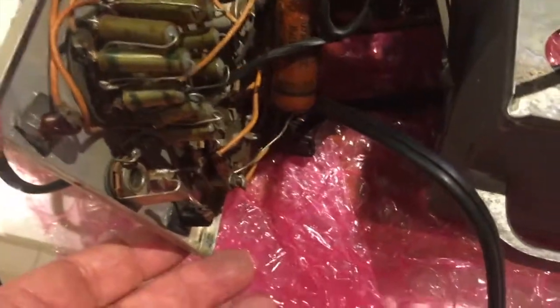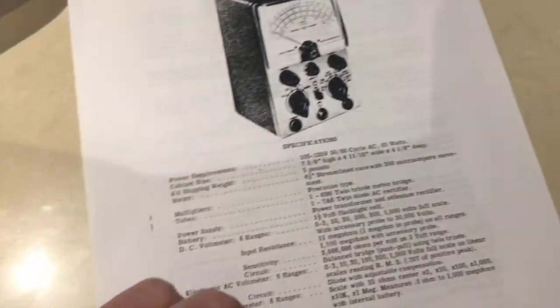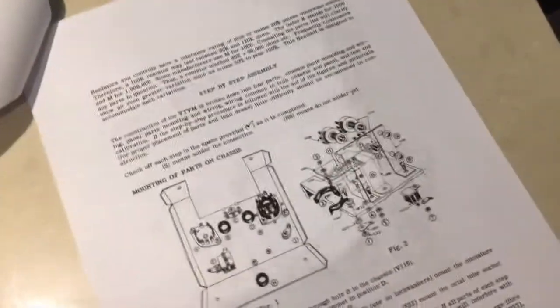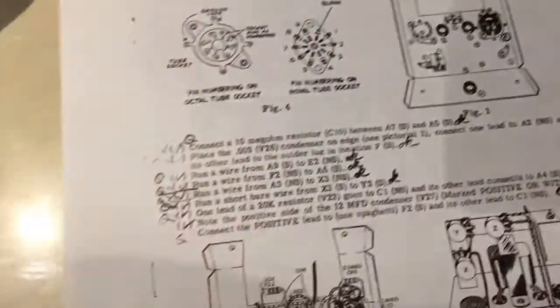I don't have to use the VTVM — I've actually got an oscilloscope I could use, but oscilloscopes are obviously much more difficult to set up and adjust. I'll have to check that vacuum tube, and I've got a battery in here. I also have to find what I did with the probe. Fortunately I've got the original instruction manual here. Since this was a kit that somebody built up, copies of the original Heathkit instruction manuals are still available on the internet, which will tell you step by step how to assemble the unit — very handy for troubleshooting.